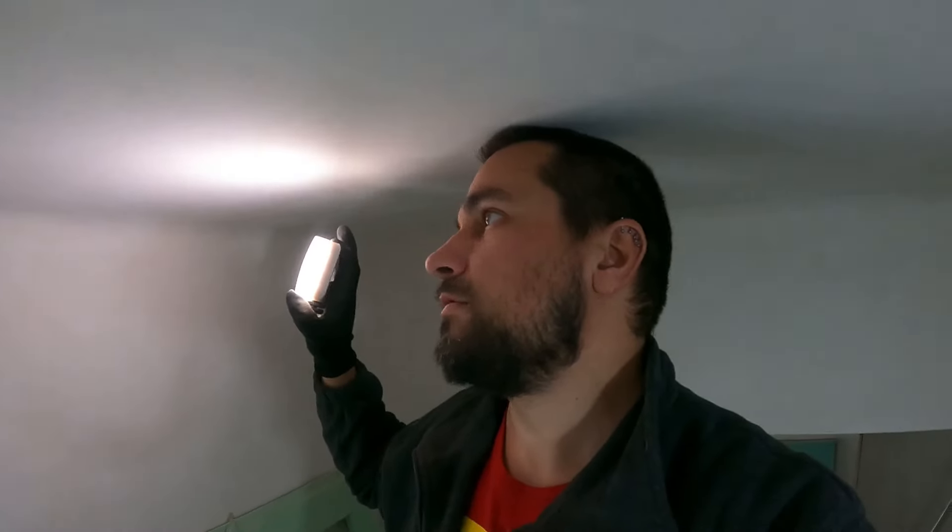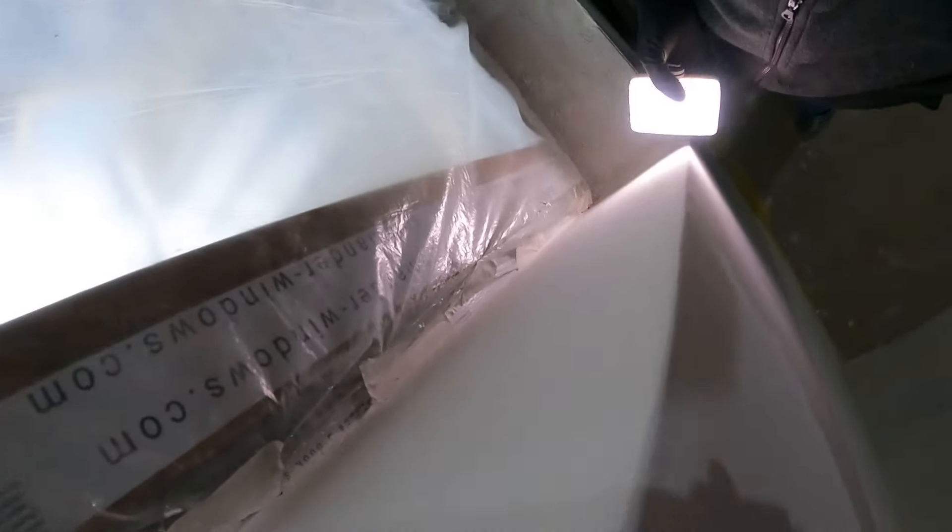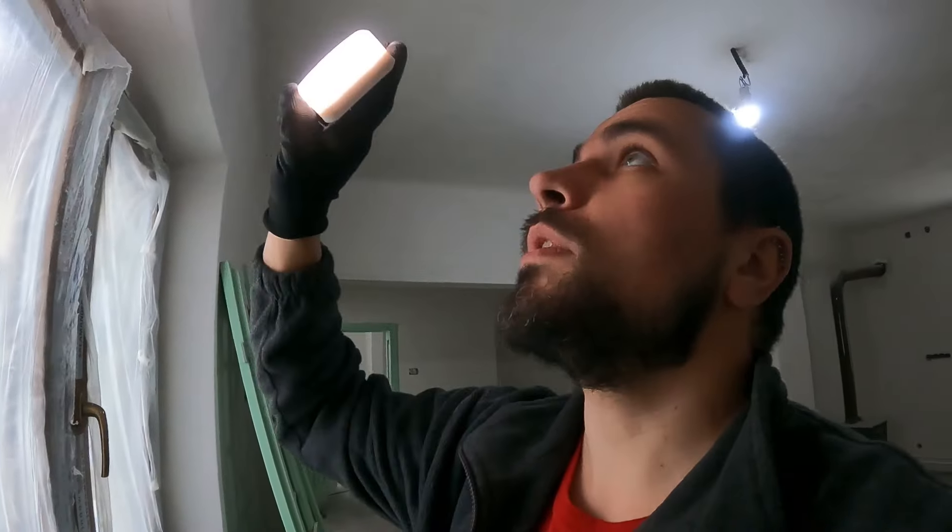Afterwards I went again with my lamp, found a couple more, and just held a piece of sandpaper in my hand and did it myself. Some of the more intricate parts were these edges around the windows — there's a profile in it that resulted in the mesh being exposed when he sanded a little bit too much. It appeared in a lot of places, so I asked the guy to re-plaster those bits and then just lightly sand it, and it turned out well.